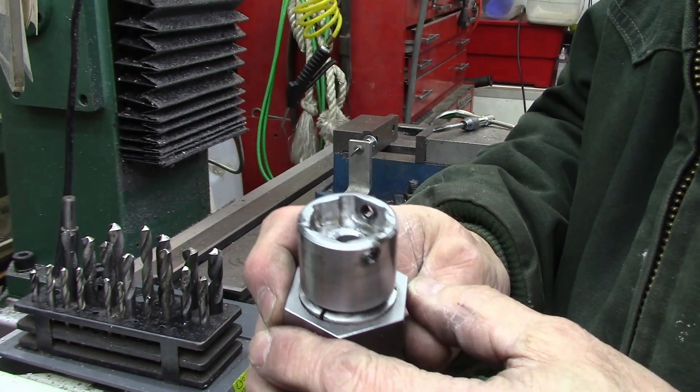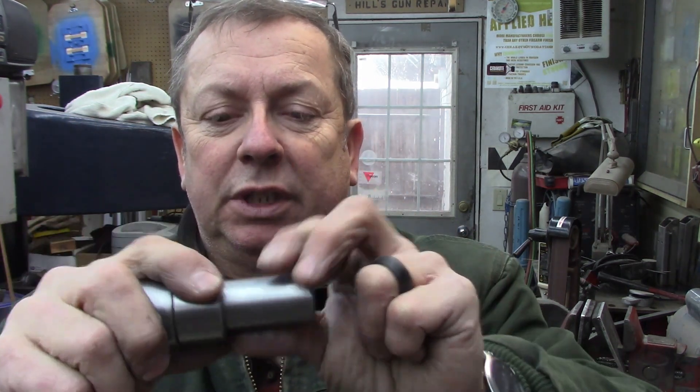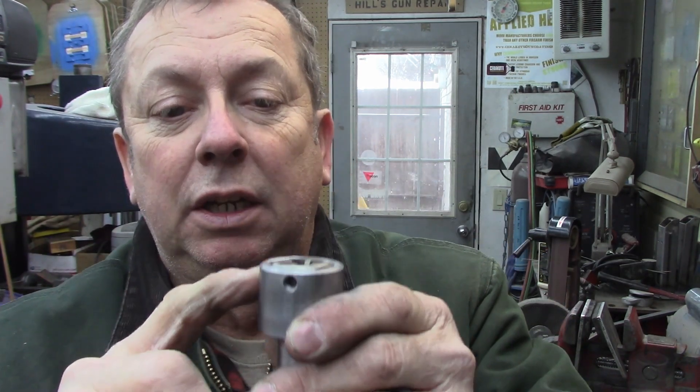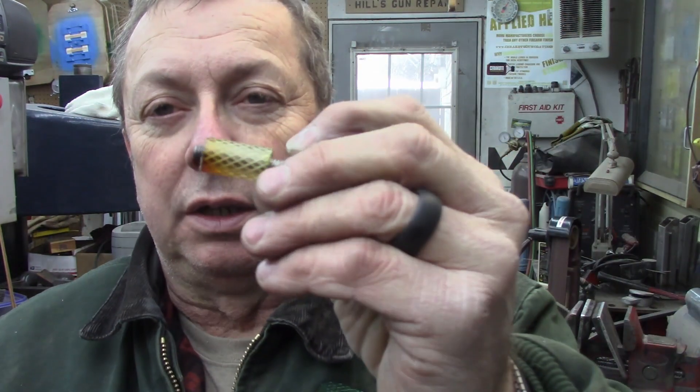I had a little boo-boo when machining the cutout — won't make a bit of difference. Let me finish cleaning up and deepen the inside of the threaded holes. Back into design considerations — here's the head and base plate. I have to put my drive pin in yet for release, and I've got to turn the little threaded cap to go in there with the spring to retain it. There's a little polishing to do on the inside as I'm lacking clearance for my spring.